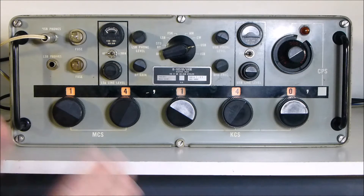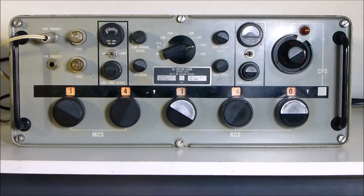It really is a single sideband receiver that also provides AM. CW was probably a requirement, but when you bear in mind the CW on this set runs with a very low BFO injection, not particularly stable, and in an 8kHz bandwidth, you can see it really wasn't of much use in any real sense of what CW is intended for.